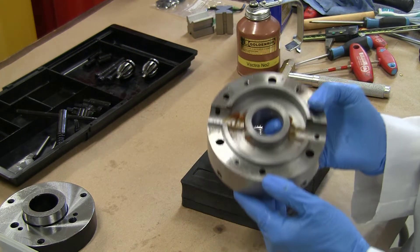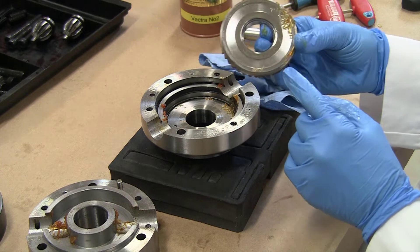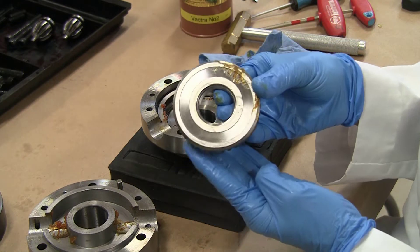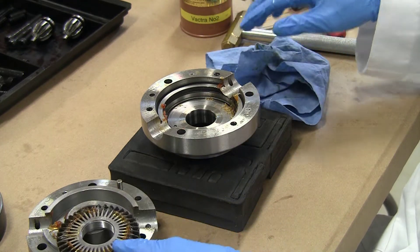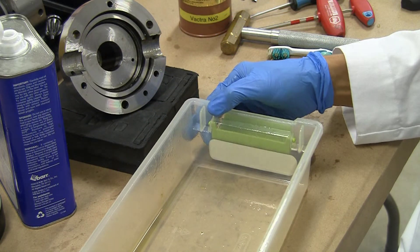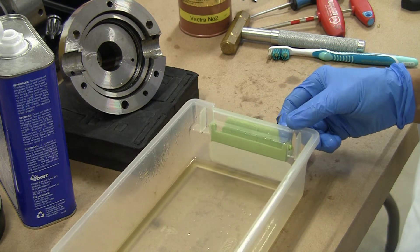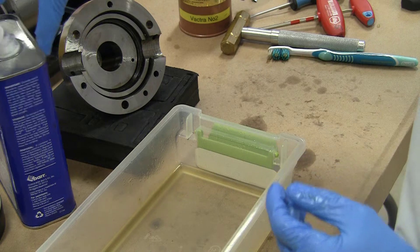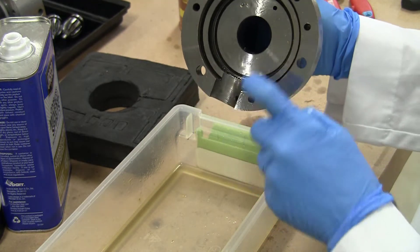The inside looks very nice and clean — not a lot of grease in there and it doesn't look dirty at all. The bevel gear has got grease on the teeth but nothing much on the mating surface. Most likely it is for oil to get in there. After washing the two halves in mineral spirits, there is a slight bit of color, probably from the grease, but no particles, crud, grit, or metal chips. The surfaces are very well ground.